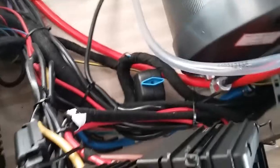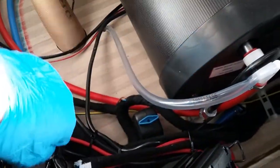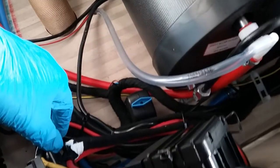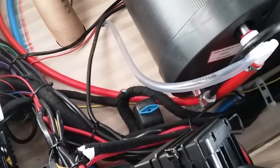If this drain valve just automatically opens due to it being too cold, all you need to do to reset it is just push the blue button back in again. If it will not stay in, it's just too cold and you'll need to turn your heating on to generate some heat to allow it to reset. So just remember, the only time you're touching this blue diamond is when you are manually draining the boiler down.